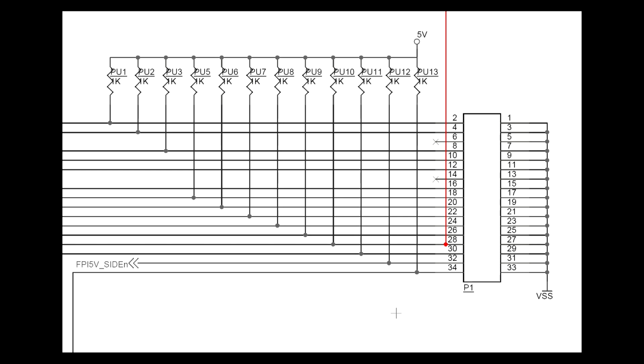I just want to show this and talk a little bit about this. So hopefully you guys that are creating these new Amiga 500 and 2000 motherboards, maybe you watch this video and it gives you an idea. You can change the traces on the motherboard to accept, instead of 23-pin sub-D connectors, the 15-pin sub-D connectors that you can solder in instead.